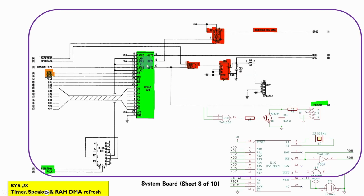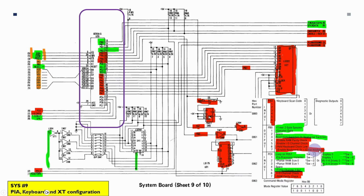So this is the timer. We are going to need a timer. You can see here that it uses the X bus control signals. We are going to be using this circuit here. We'll use one based on the XI8088, which doesn't require this chip, just uses a gate and a transistor. And the real-time clock that we'll be adding in a later phase is also going to be added here. There are some control signals here that we'll look at in a minute that we need for that. So this is one of the areas that needs the most changes.